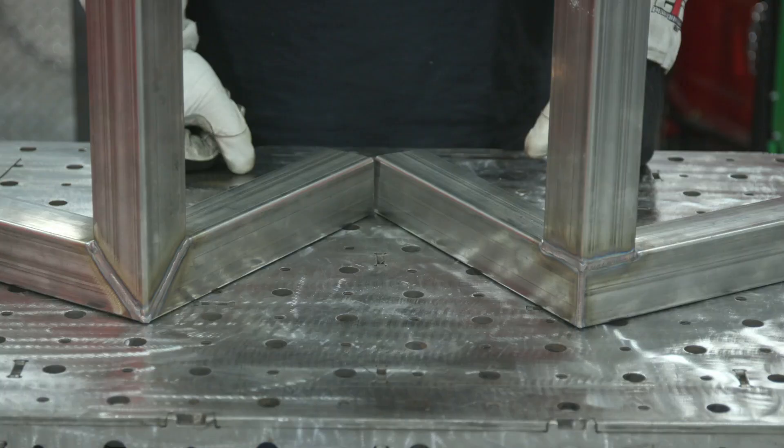As you can see, the single miter on your right is more structurally sound as the tube is supporting the bottom with the full weight of the tube. The double miter on your left is more aesthetically pleasing to some. With thicker tubing you can bevel more, run a single pass root fill with an ER70S-2 or ER70S-6, then go silicone bronze on the fill, grind it out, and get a nice bright yellow line in the middle. Some people like it for furniture when you black the metal as a finish.